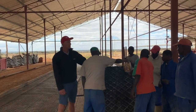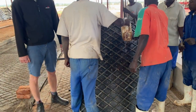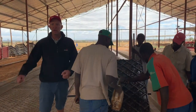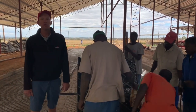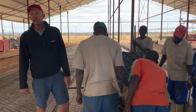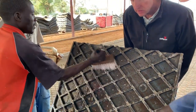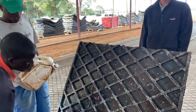Here you can see the stencil that we've made. They are applying Rhino cast to it, which prevents the cement sticking to it when we are imprinting it into the wet cement. The guys apply that liberally with a brush and then we imprint it into the already cast concrete.